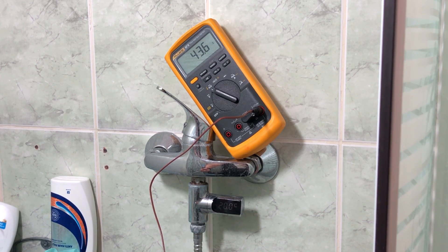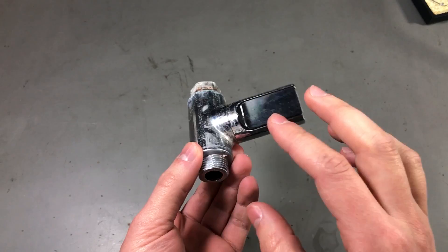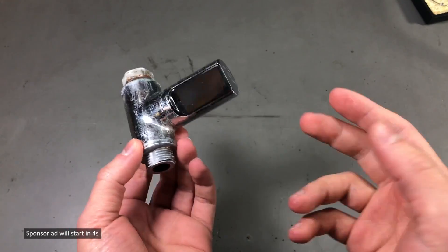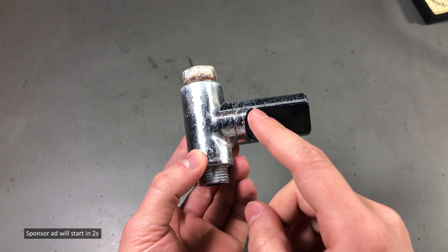It is showing about 23 degrees Celsius lower than the actual temperature. So I wonder how this degradation occurred — maybe we can figure something out in the teardown, but I'm suspecting some kind of corrosion on the thermocouple or sensing circuit inside.